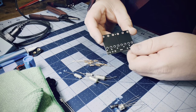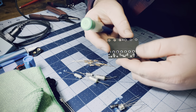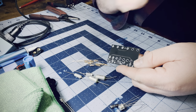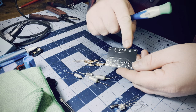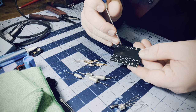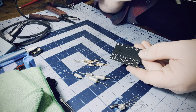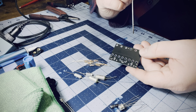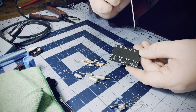Essentially you've got a hybrid setup — you have eyelets here. Most of the circuit is still point to point; there are a few traces on the bottom. There's one here that goes across and down to this pad, and those are just hooking up all the grounds. Up here you've got one trace connecting these two, hooking up the power — in this case, negative nine volts. You've got just a few traces for the ins and outs on the pots down here. Here's the output into the pot and then the output that goes to the switch; here's the input from the switch that goes into the circuit. And this is just for the LED to turn it on and off.